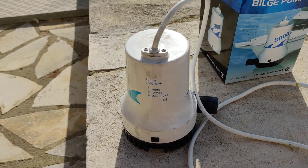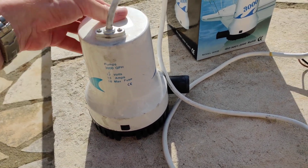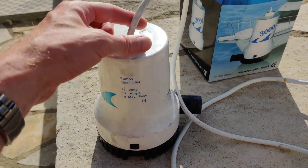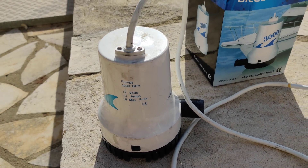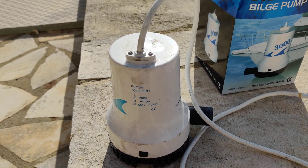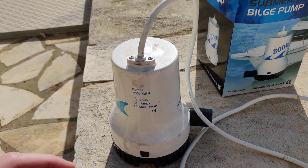A couple of issues with the pump: water gets into them. I tried it on the upper steps with only the top sticking out of the swimming pool, but I found the first one split and allowed water to get in. This one I think just with the constant heating up and cooling down, water seeps in through the O-ring seal in the gland. The pumps are around 50 euros, so the benefit versus the cost to change it roughly every season is a small outlay. I'll eventually hopefully find a better pump, but I'd probably need to upgrade the solar panels to increase load capacity.